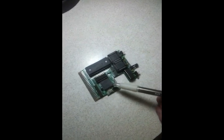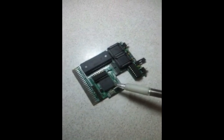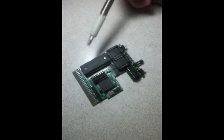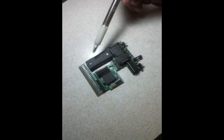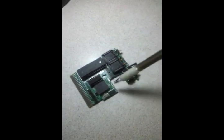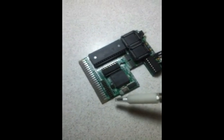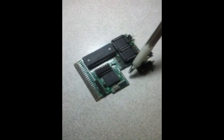We have here probably the main part of the entire FEU, which is a Xilinx CPLD. Over here we have two flash ROMs — that's one megabyte of flash in total — and this is 128K of SRAM. We've got a reset button, a freeze button, and there's a chunk missing out of the board, which is there for a reason because over here we also have a clock port connector. That allows expandability — things like an Ethernet board or an RTC board.